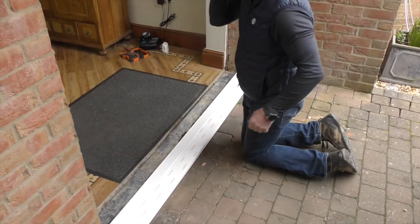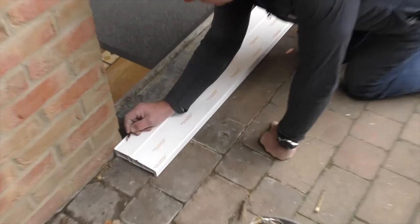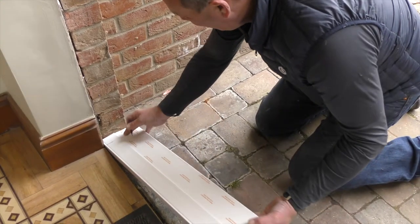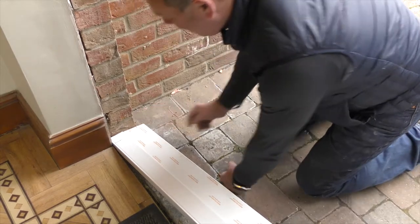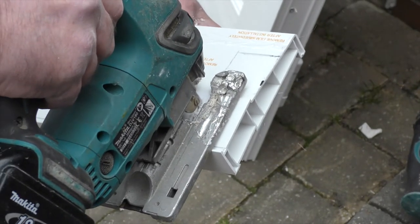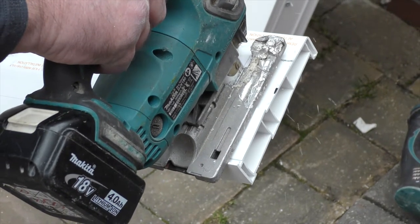The need for any sill should be determined at the beginning of the project. The sill should have an overhang of at least 25mm from the face of the building. The installer should determine how the sill should be fitted, taking into account features such as horns. An additional 100mm length of sill is provided to allow for shoe horns. Measure and cut the sill to the required size, taking into account shoe horns if desired.